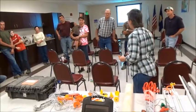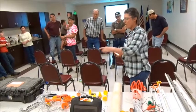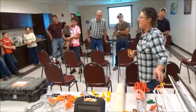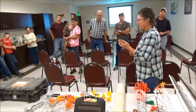It's nothing, it's twine. You need a fence that's over 4. If it's not over 4, there's something wrong with your twine. There's something wrong with your leads. Maybe there's something wrong with your ground. You have to be able to check it.